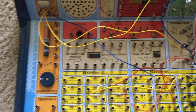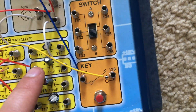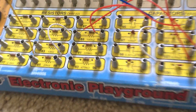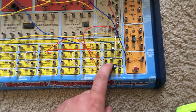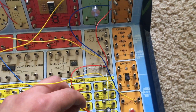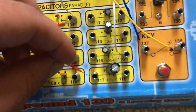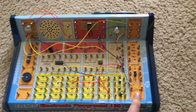You can make many different modifications to this circuit. I am going to disconnect the 10 microfarad capacitor and connect the 100 microfarad one. The start-up and wind-down will be much longer because this capacitor takes longer to charge and discharge — it might sound more like a firehouse or tornado siren. Now I'm connecting the 470 microfarad capacitor, and both the start-up and wind-down are even slower.